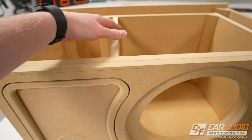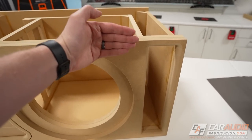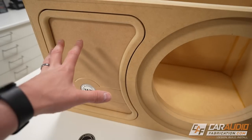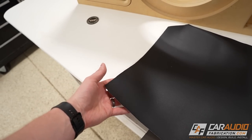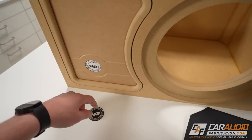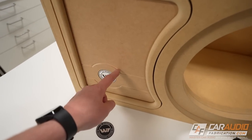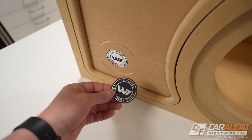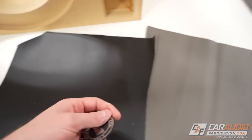I still need to attach the top of the enclosure and permanently mount the front baffle — I'll apply wood glue, make sure I get complete uniform surface coverage, and clamp it in position to dry. In the next video we need to do our finishing techniques. I'm going to be doing the Duratex coating, but we're also going to be doing some vinyl wrapping. I've got this nice black vinyl with a medium grain for the outer trim ring, and this gray vinyl — a little bit lighter — for the inner piece so we'll be able to see the nice shadow lines from our detail work. I still need to decide if I like the light colored emblem or the dark colored emblem against this color, so let me know your thoughts.